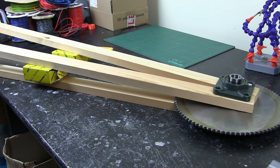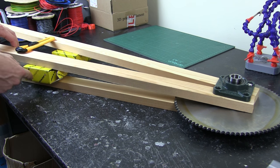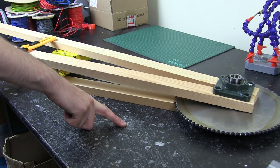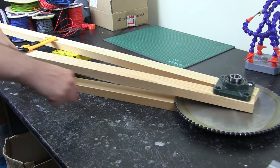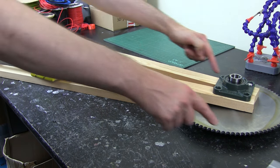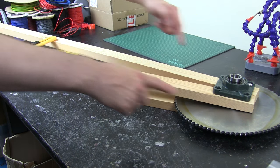At the top it's not going to be quite this long. We can have some shafts that go through here to anchor the top of the thing that pulls — so we've got those blocks and tackles in there. We can have a rod coming through here with load spread on steel plates, top and bottom piece of 8mm studding. So we've got this kind of triangle going this way and then another triangle coming in this way. The motor will mount in the middle. Those strings come down and come almost in line with the ones that are already triangular shaped.